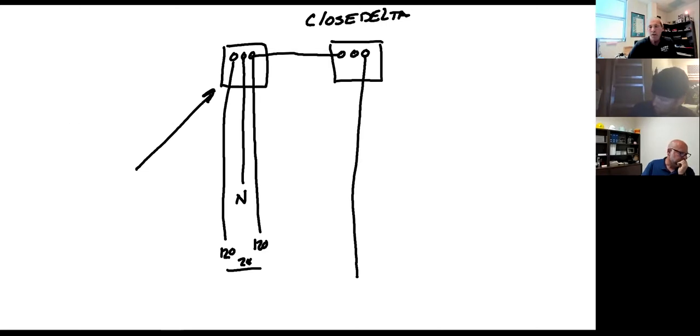So I just want you guys to right now know the identification part. If you were to drive by or stand by three transformers on a pole and look at the center transformer, for three transformers that is going to be your primary. That's going to be the one that tells you either Y or delta. Three wires coming out of the center transformer, delta. Three transformers, closed delta. Two transformers, open delta. Two wires coming out of the center transformer, Y. That's how you're able to designate those.